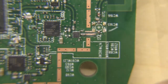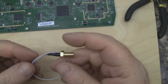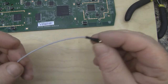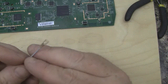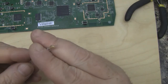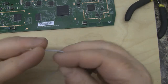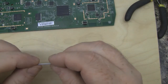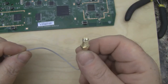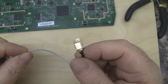The connectors I'm using for this modification are SMA connectors, purchased off eBay. They come pre-crimped with a length of thin coax already attached — like the kind you'd find in a laptop. I'm going to cut off the Hirose connector end, strip it back, and solder it directly onto the PCB. There'll be enough length to drill into the case and have it protruding out so I can attach a dipole antenna or whatever I want.